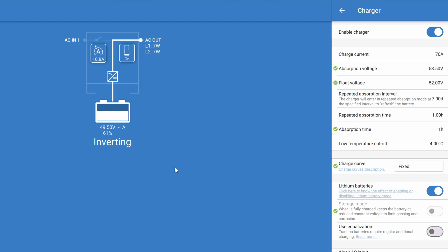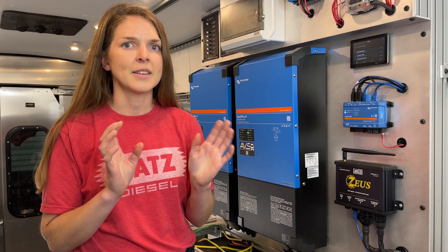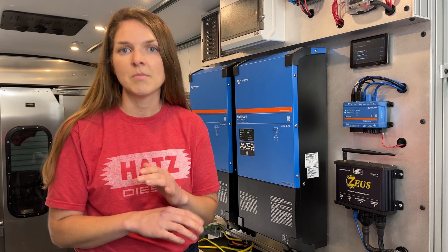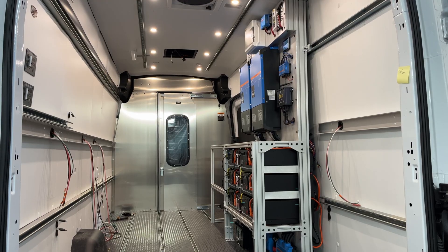As an aside, the communications and DVCC has no impact on your low voltage set points of your inverter. If you set a voltage that is too high, your inverters will shut down long before your batteries are asking to stop discharging. So again, this is why we want to commission these systems, not just plug them in and send them down the road with default settings.